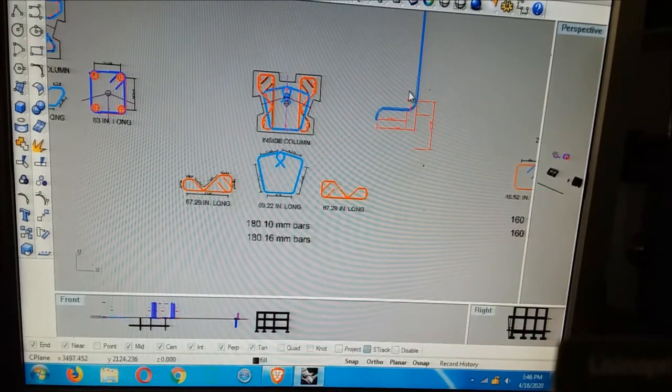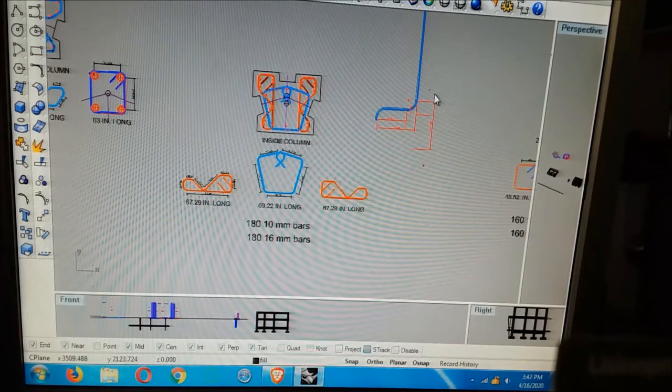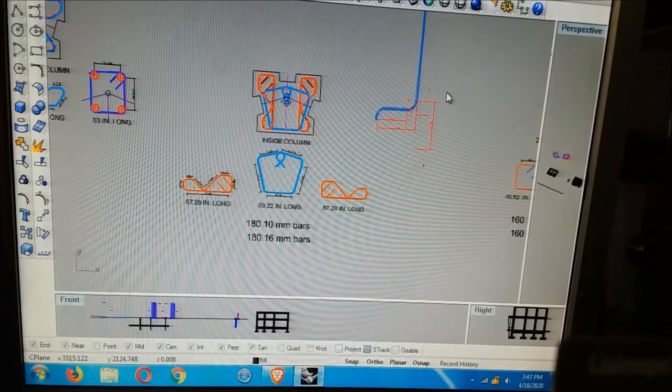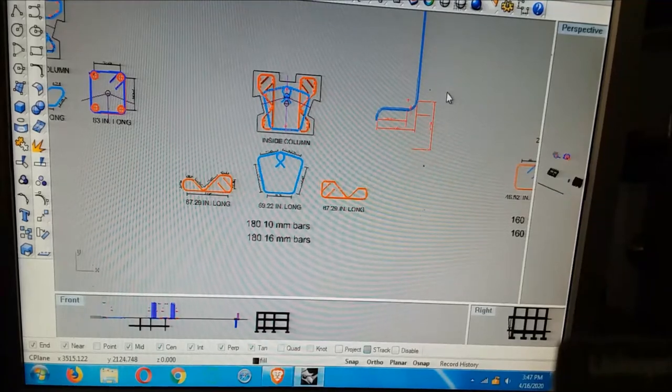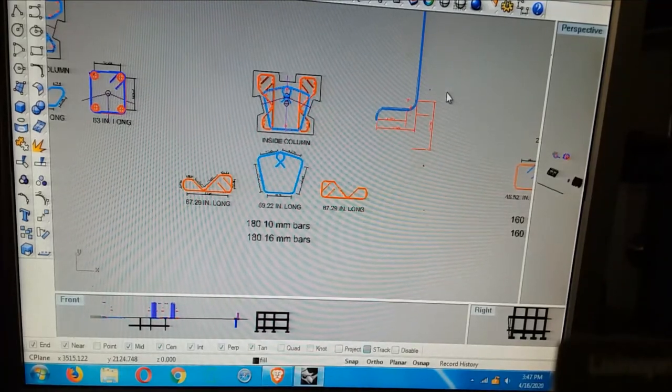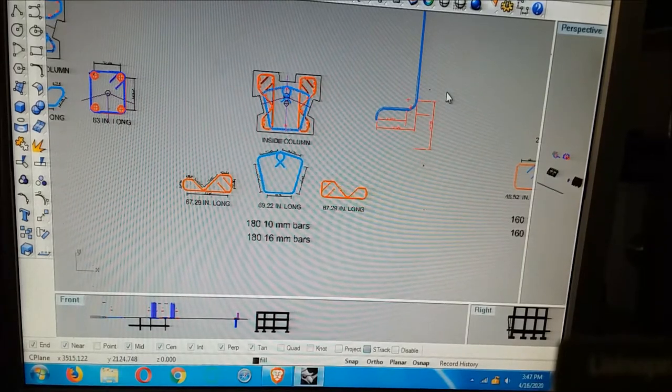Don't like laser transits. I've got no accuracy in laser transits. I've had people set up foundations for me that were perfect on laser transit. But I build machinery that bolts to that concrete. It won't stand a half inch. The metal is just too stiff. You can't pull it down to it. The machinery was just built too strong for something to be unlevel.